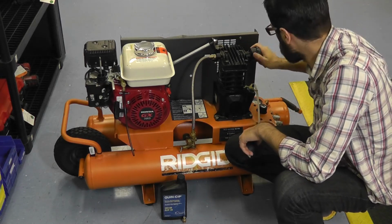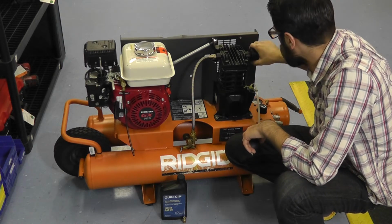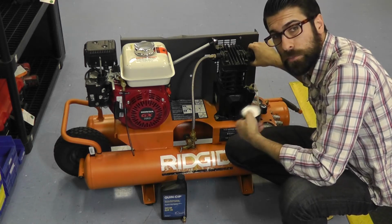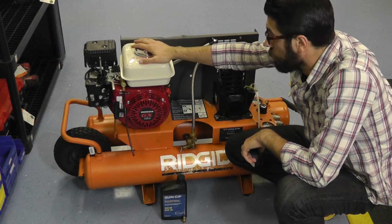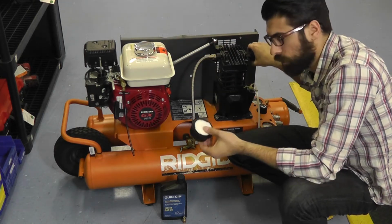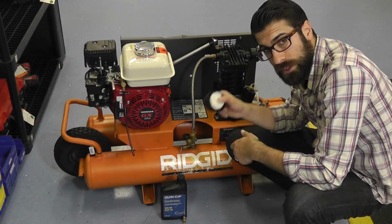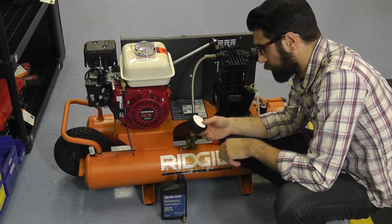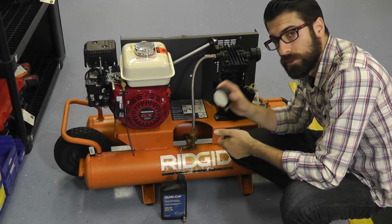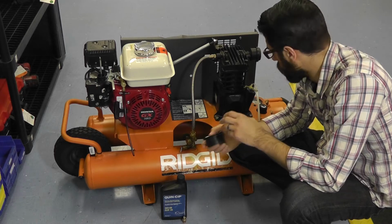The element inside, make sure the medium is clean, especially if you work in dusty environments like, say, this, cutting wood with all that sawdust, or even painting, with all those particulates, and carbon from the engine and exhaust gets sucked through the intake. So every 3 or 4 months, go ahead and change the filter out. We sell the replacements and we discount them by quantity. Always keep more than one on hand, because that's just more downtime and more shipping cost. So it's ideal to replace the filter then and order a few at a time.